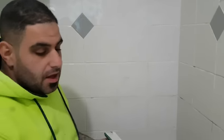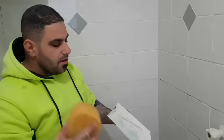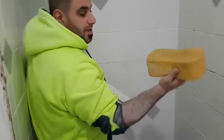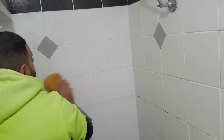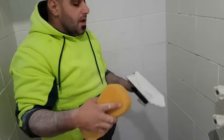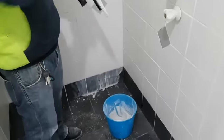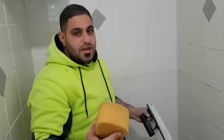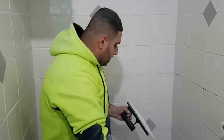Quick note: if you find your grout is drying rapidly or if you have a really hot day — I had the heater on here and the tiles were sucking the water out of the grout pretty quickly — use a damp sponge and just sponge it down to keep it moist. It will help with your work time and make it a lot easier to apply the grout. In really hot conditions, lightly mist after you put it on, which allows proper drying time and prevents cracking.